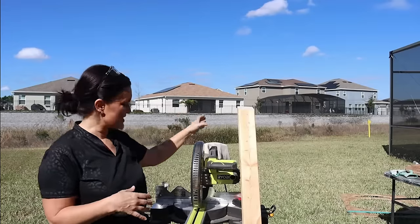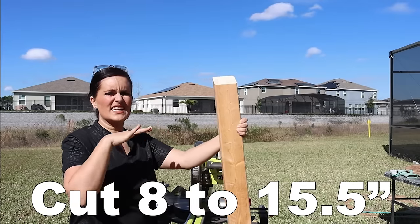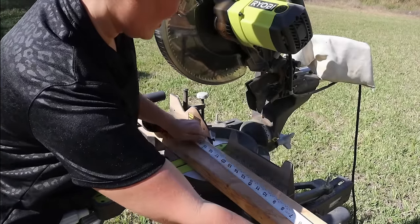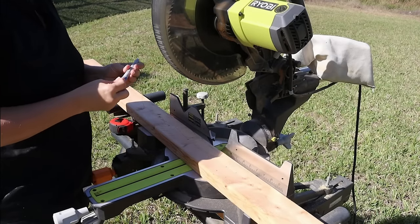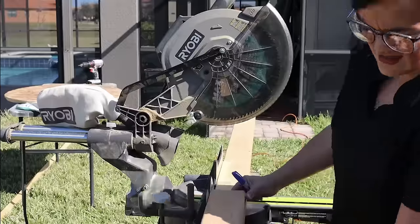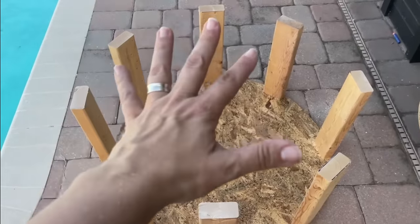We need the height, so I'm going to use some scrap lumber from my scrap pile — a two-by-four, or you could use a two-by-three. We're going to cut eight of them to 15 and a half inch heights because by the time you add in the feet, the plywood circles, the batting, and all of that, the end height should be around 18 to 18 and a half inches. Don't forget to put safety glasses on — safe is sexy, ladies! I've evenly spaced these around the circle and now we're going to attach the top and bottom to them using a framing nailer, though feel free to use a drill to screw them into place.